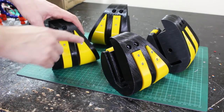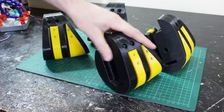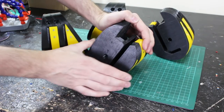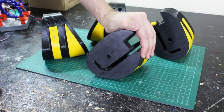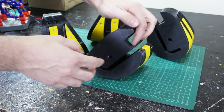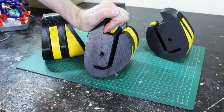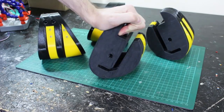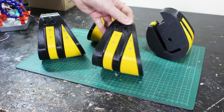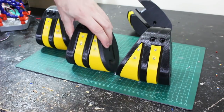And here they are. We've got Ninja Flex inserts with countersunk screws holding those on, so we've got lots of nice grip there, and these are pretty tough so they're not gonna break any time soon. They do have those slots in there, so you can see that's quite squashy. We'll put something in there as well to prevent it squashing fully and measure the squash — probably some foam, maybe a force-sensitive resistor. There's opposite pairs that fit together, so let's get those on the dog and get it re-postured.